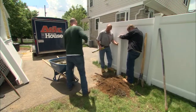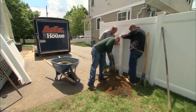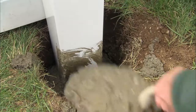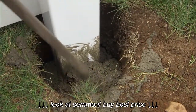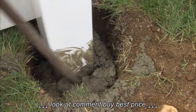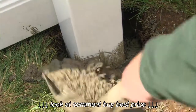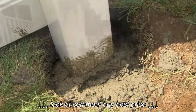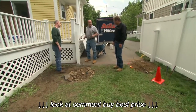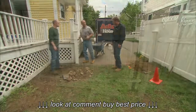We'll use some more concrete all the way around. We'll leave three inches at the top so we have some grass to grow around it. Just using the bar to make sure it's well distributed around the post. Now we have both gate posts set — they have to cure in the concrete for 24 hours before we can hang the gates. I'll put the cap on and we'll go start on the six-foot fence.